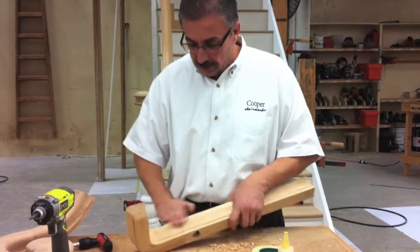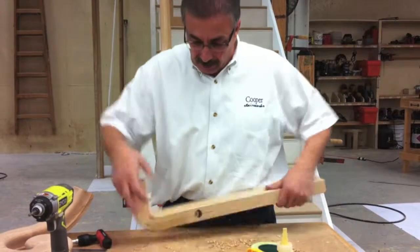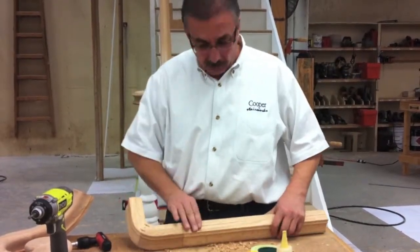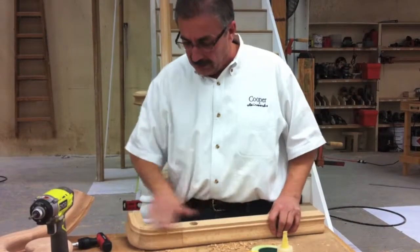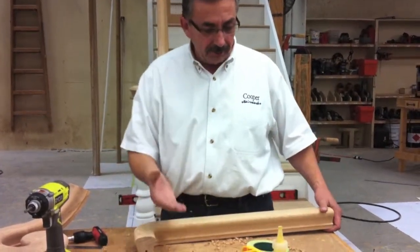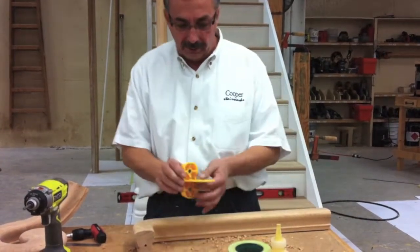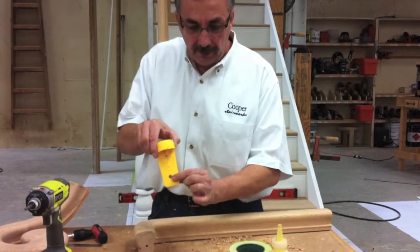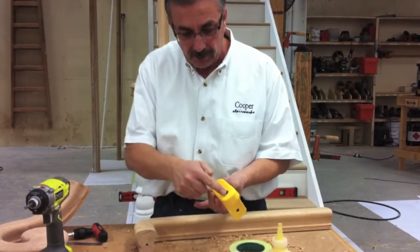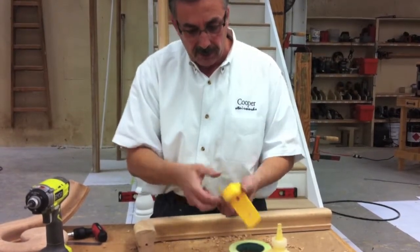So you're all tightened up now and you get that as close as you can. And then all you do is finish sand, blending that in, making sure certainly that the fitting is flat and where you want it to go. And you apply the 1-inch plug and then sand that like you normally would and you have your fitting. And you can see, it really doesn't take long. With one line going down the center, you can align that up with your little windows you have here. You have the guides to make sure it goes in nice and straight.